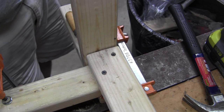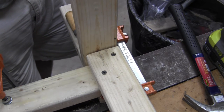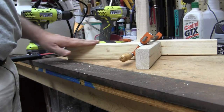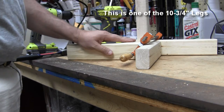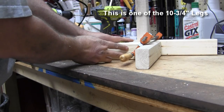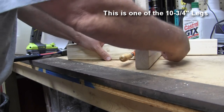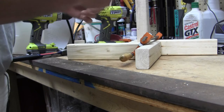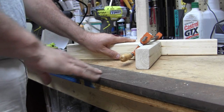For the final leg, number four, I created a flat enough space on the workbench to get it level, clamped it down, drilled two holes plus one into the adjoining piece, and got one or two more in from the side. Once it's mounted I'll spin around to add more screws until everything is good and tight — two or three screws will make this thing really solid.